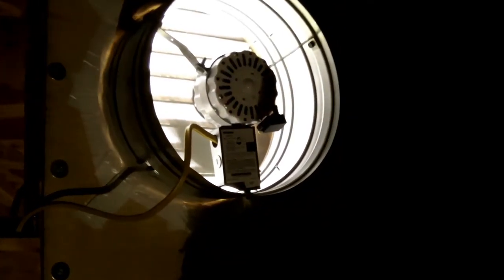Right now I'm stuffing all the switches back in the box. I already tested it - everything works, thankfully, that's why I'm putting the switches back in the box. That loud noise is the fan working. Everything was hooked up correctly, miraculously, but it wasn't too difficult. Just make sure you make a good diagram of where all your wires go when you start, and hook up your wires into the proper places when you're finishing up. This one has a thermostat on it, so right now it's about 120 degrees in here. If I turn this down, the thermostat controls it and it just turns off.